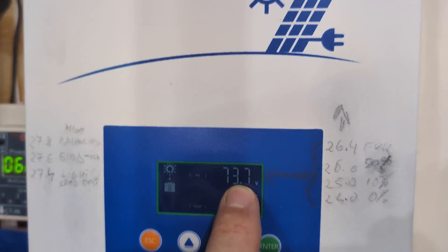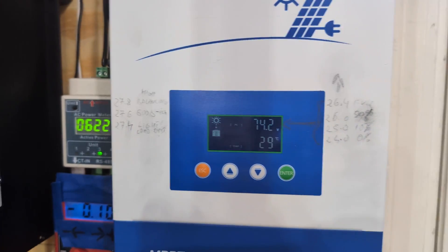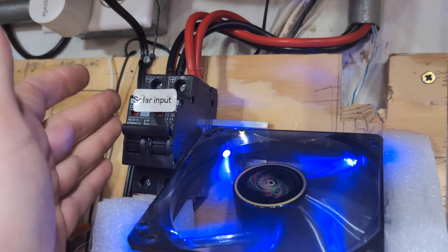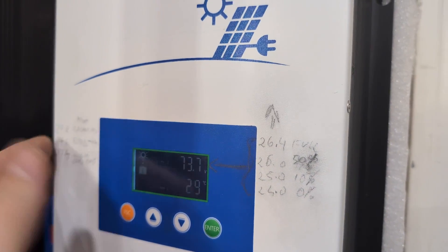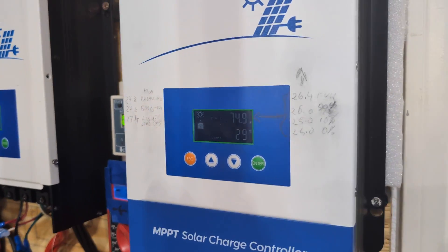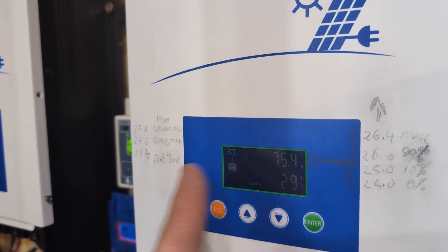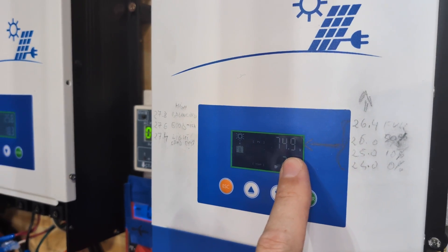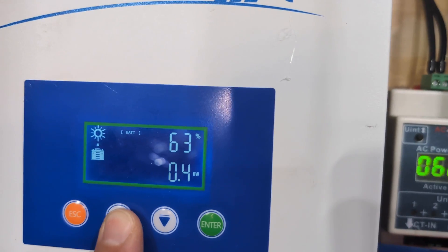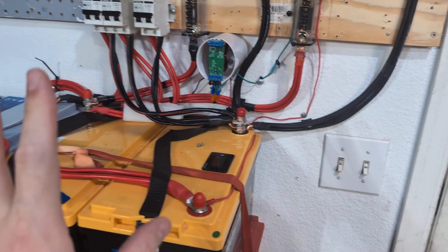Why is running under 80 volts important? Under 80 volts is considered low voltage, so you don't need arc protection and all the other stuff that many solar systems require. Because of that I run a little more amps - about 60 amps coming in - but I'd rather run more amps than high voltage because then I don't have to obey high voltage rules. If the fire department discovers you running 150 volts without authorization it could be a problem, but under 80 volts this is fine. Usually MPPT is around 60 amps; it's early morning so it hasn't caught up yet. I have 100 amp fuses on each charge controller to push power into the batteries.